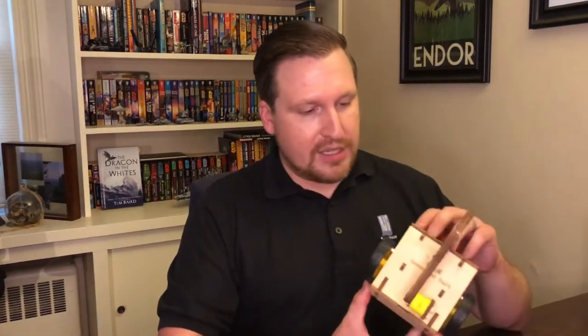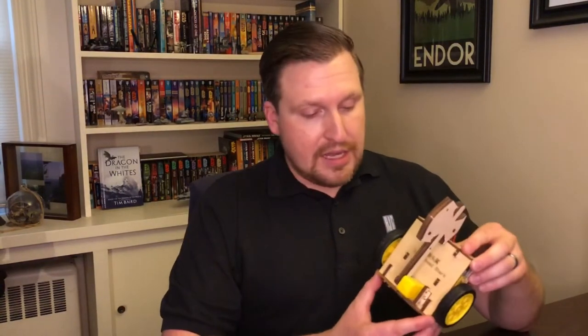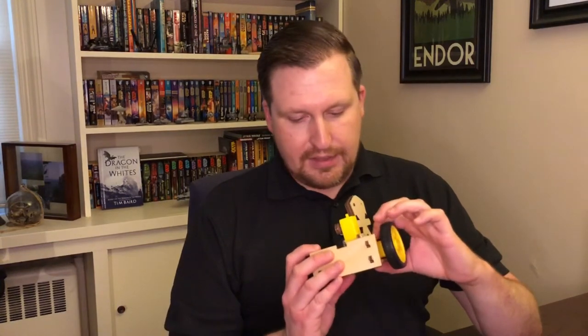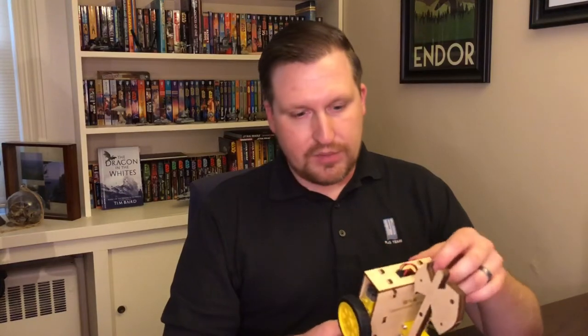The differences and things I noticed: starting simply with the controller — last time I put the battery cover on, this time I just left it off because it's a lot easier and less likely to break stuff. I figured I don't really care if the batteries are exposed. For the robot itself, this one was kind of tricky. The tolerancing on the cuts and pockets were really tight. The bolts really had a hard time going through the wood where they should have been slip-fit holes. By that same account, the screws that went in and actually bit into the wood worked really well. Just note that when you go to put them together, especially these square pockets — I can't really fault whoever did the wood cutting, because to get that laser burn in there and get that size rectangle to match with just enough of a press fit is really hard. It's wood — it's organic. It's not like machining stainless steel with ten-thousandths precision.